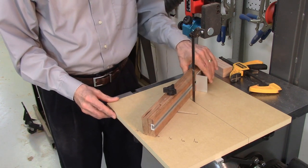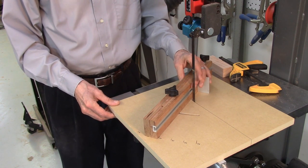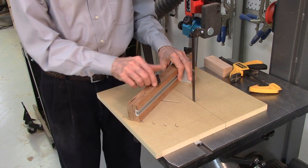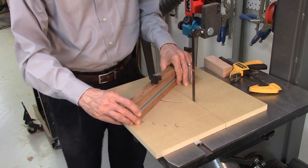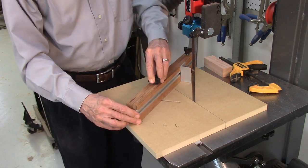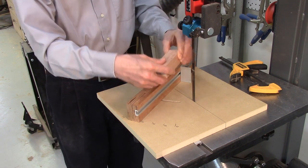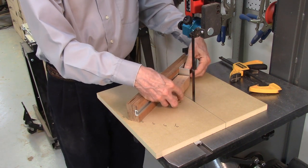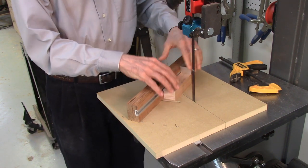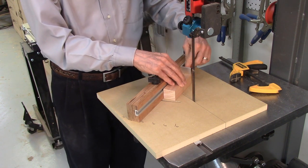The operator needs to manually watch and carefully stop the cut before it goes all the way through the board. When you're ready to cut, you first set your angle — in this case 60 degrees — and lock it in place. Then adjust where on the wood you're going to make your cut using the stop, and lock that in place.